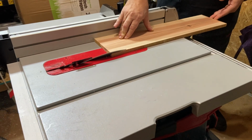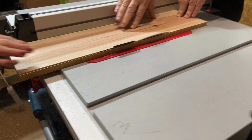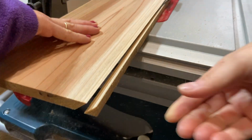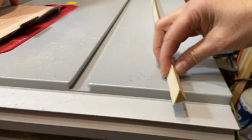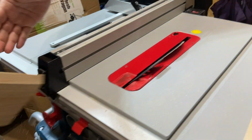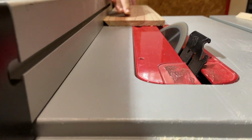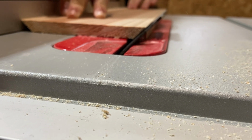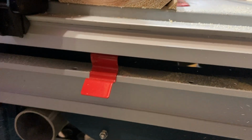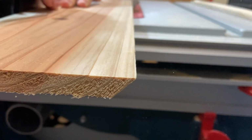Feel our pain. I found that the best tool to make 45 cuts is my table saw. So I've been very consistently using it. The key to have a nice 45 is a very steady rate of feeding the material through your table saw. And then just feel for any strange behavior of the saw. A whining motor or great resistance might tell you something is wrong. Once you have the width set, simply turn it over and you're going to have two perfect 45s without having to continuously count and count again. Also, once you set your saw, make all the cuts of the same dimension, and that will ensure your accuracy without having to reset constantly. When you follow the simple steps, you're going to have consistently great results with your table saw.